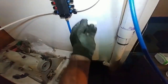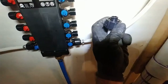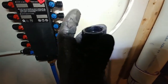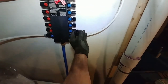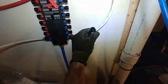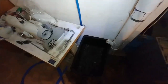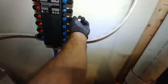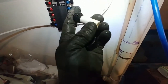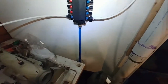But ultimately you can run that down tight, and it's an O-ring. See him on there? That makes that tight connection. Now, in theory, you can move these around and change things around without ever having to cut and re-crimp an end, unless you make a major change. So the point is, what they supply for this component that fits into the PEX and attaches to here once it's under that collar is for half-inch diameter PEX, and I don't know that I can get it for 3/4, so then we can't take 3/4 anywhere.